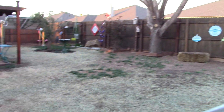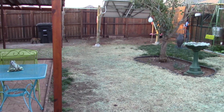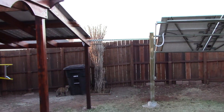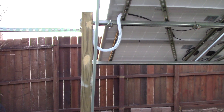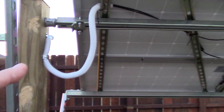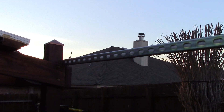Let's go over here to the other array. I just woke up so bear with me. Essentially, I used the wiring that was on this array and moved it over to the new one. I didn't have enough cable so I had to make my own PV cable — it's wired in here, actually 12 gauge. I'm going to replace it with 10 gauge just because I'd rather have 10; 12 would be fine but I prefer 10.